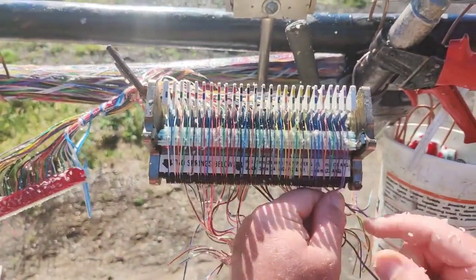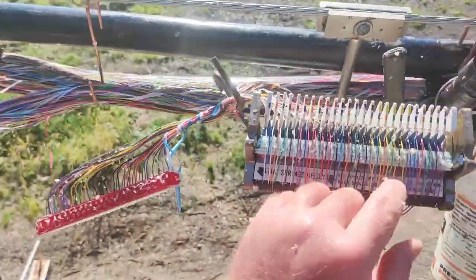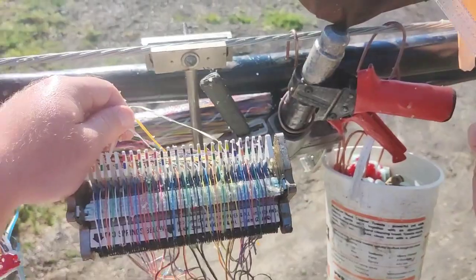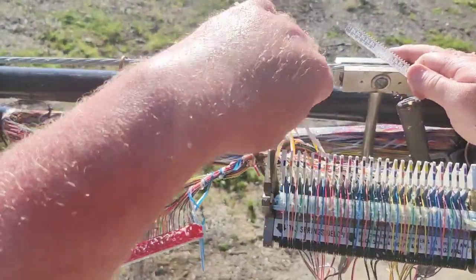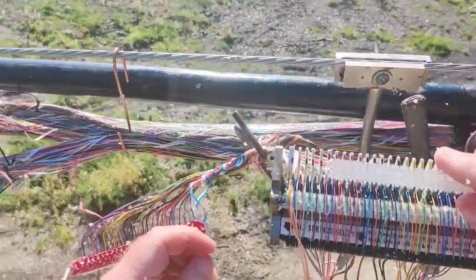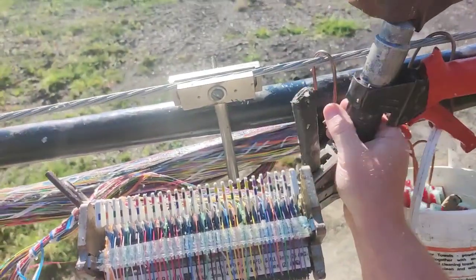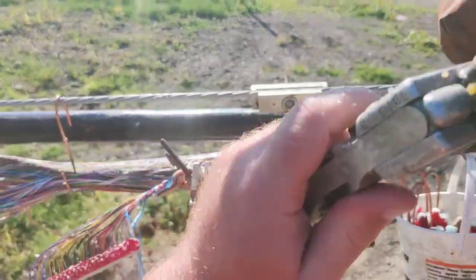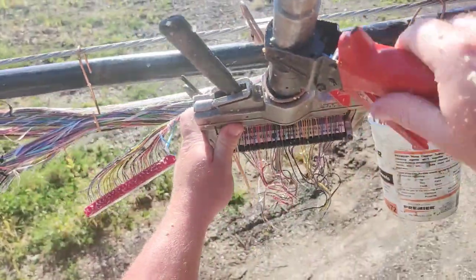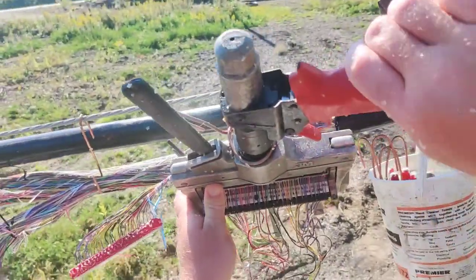Make sure you've got your tips on the left and rings on the right. Now, what I do differently from anything I've seen on YouTube: before I put my cap down, I take my binders — those strings for the binder — and lay them in right by the white-blue. Then I lay my cap in and make sure none of them are jumping the track. This happens more often with the pluggables than the minis; the minis sit down in the caps a little better. Take your hydraulic crimp head, slide it on there, step back, and start squeezing. Once it reaches the point where you're done, it'll click and you'll know.